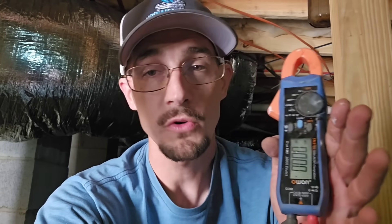Just for full transparency, anyone can diagnose a well pump system. All they need is a clamp-style amp meter. I bought this one on Amazon for $18. They also have $60 and $80 ones, or you can go to Harbor Freight for $16. You clamp it on one wire and that'll tell you if your well pump is bad or not — preventing you from pulling your pump out unnecessarily. You just need to know the horsepower rating of your pump.